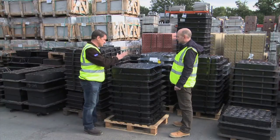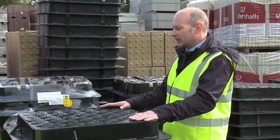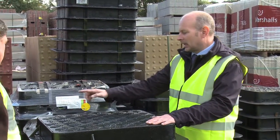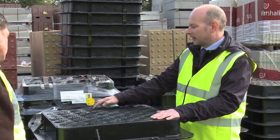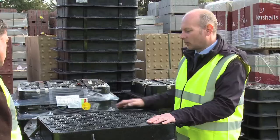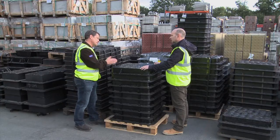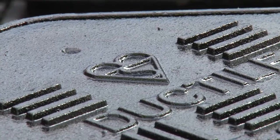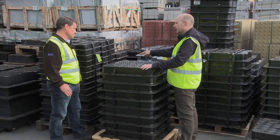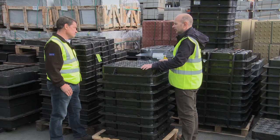So where are we going to start Paul? There are lots of different numbers and letters on this one. Well Tony, this is a heavy duty access cover and frame manufactured from ductile iron. This one has a kite mark on there and is manufactured by Peter Savage Ltd. It's to European standard EN124 and it's a D400 loading. This kite mark is the BSI kite mark — importantly, this is the third party accreditation that it conforms to BS EN124, the European standard.